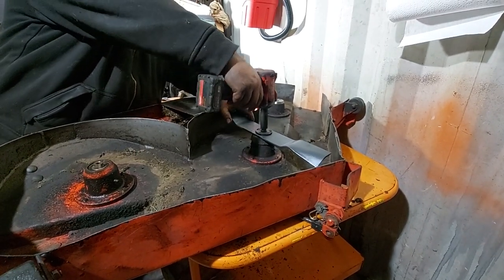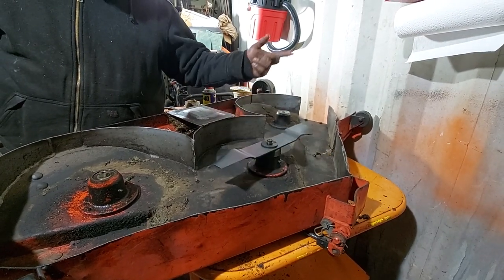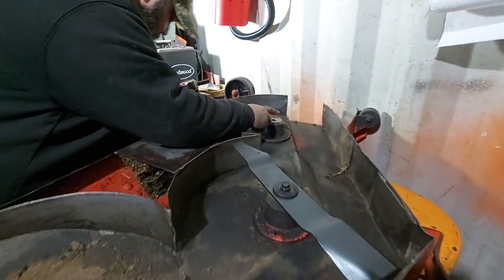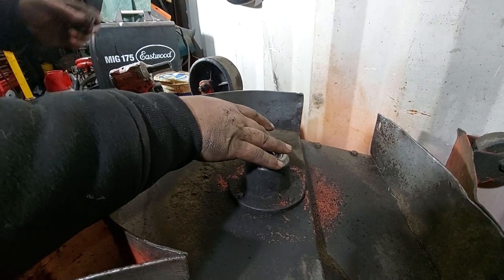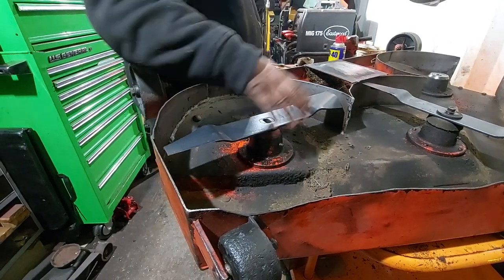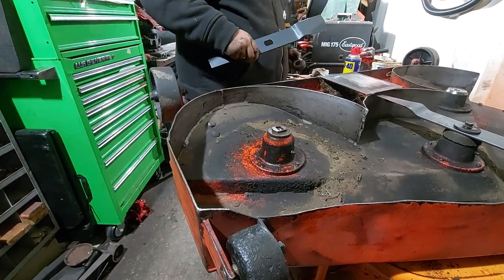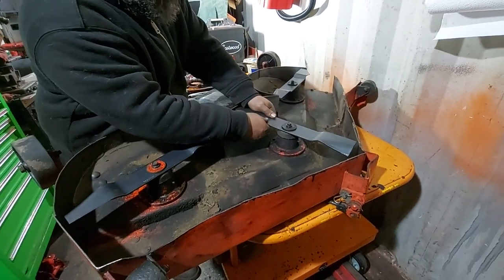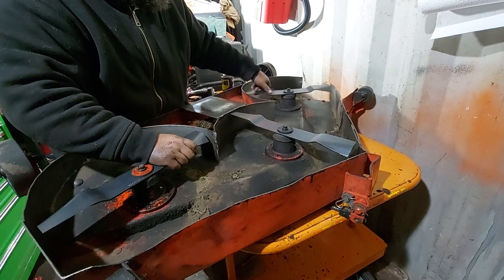These have to be pretty tight — you don't want these blades going flying, but you don't want to break the bolt off inside the spindle either. Use your head; if you're using a hand tool you'll have to wedge the blade so it doesn't spin as you're tightening. They should spin with a little resistance because you've got a new bearing and new grease. If they just keep spinning freely, your bearings are shot; if they don't spin at all, your bearings are shot. These decks aren't timed but I always put the blades 90 degrees from each other. Don't forget your dust cover — that goes on before the blade. As you can see, the old center spindle had play up and down, but now there's zero play here at all.